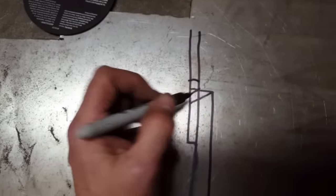All right, so I ground it all up and I've gone back again now just to show you and re-welded a few spots, you know, pinholes and edges that I didn't like, and now I'm going to go back and grind all that down and finish it up. And there it is, all finished. Now I went back and touched up a few spots a few times. Be careful grinding it off. Concentrate on the welding. Try not to grind too much of the steel off. You just got to watch that, because all you're doing is thinning out the metal itself. I've been at this for a lot of years and I keep an eye on all that.